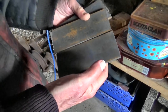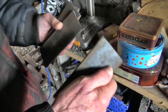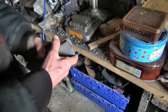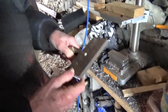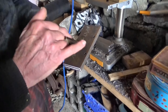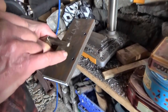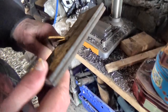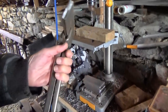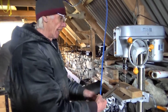Raw sleepers or pads, whatever you like to call them. They've just had in most cases the burrs ground off the end from cutting them with a 9 inch angle grinder and a cutting off stand. To join the rail sections together we're using ordinary 2 inch fencing staples which are 4mm wire. So you're drilling a 4.5 or 5mm hole in here. This one's a pattern — always write 'pattern' on the pattern, otherwise you end up using it. So basically we drill through using the pattern.